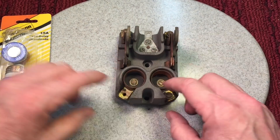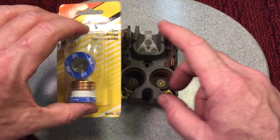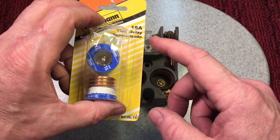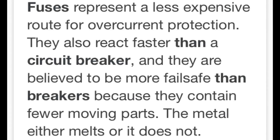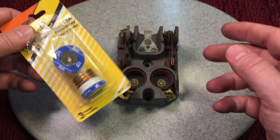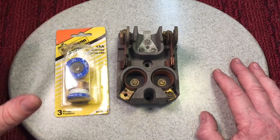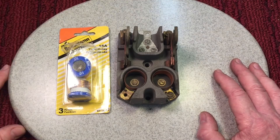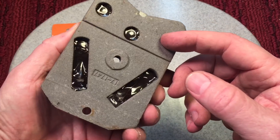And it takes fuses. Fuses are something you could still get. There are a lot of old-time electricians that actually liked the fuse. A circuit breaker is easy because when it pops, you just throw it back — but fuses were paying because they're disposable. However, a lot of electricians said the fuse was safer because it disconnected right away, whereas a circuit breaker has to heat up before it does. A circuit breaker lasts for years, but if you're putting in a sub panel and you don't have a lot of surges, you might be inclined to use something like this.